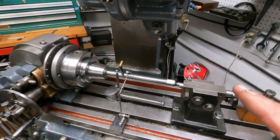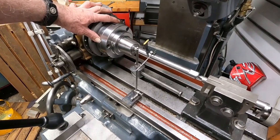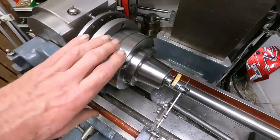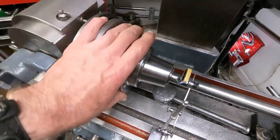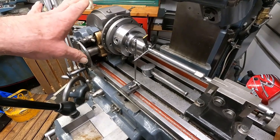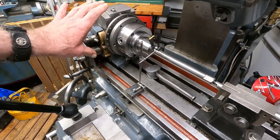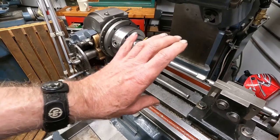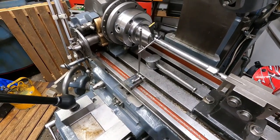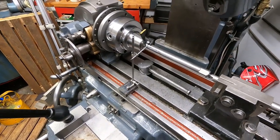So that's done. Now I'm going to make arbors and things. I've got this Bow Star import collet chuck on there that works quite well - it runs true, running better than half a thousandth. I can put a three-jaw chuck or a six-jaw chuck on here, or take this off and use the taper in the head. I need to make some arbors - I want to make a ratcheting-type 24-index plate for the Herrick air spindle, among other things.